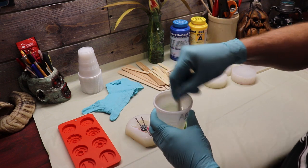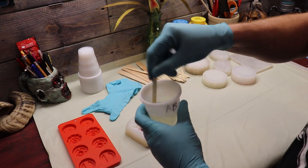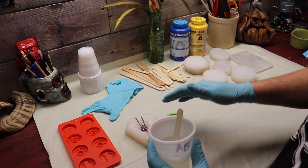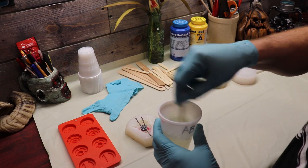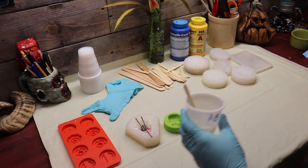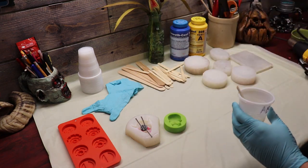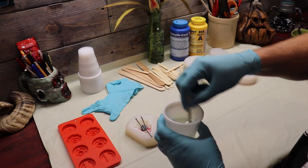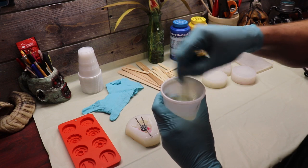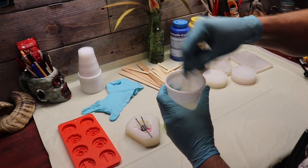We're going to mix it up real good, scraping the sides. This stuff is super easy. We've got about seven or eight minutes to mix this stuff up and it's going to cure in about 10 minutes. Then we can pop it out of the mold. Heat is a factor - if you're in a cold place, it's always a good idea to warm your molds up with a heat gun. Resin casting loves heat. This is going to feel hot in my hand - not enough to burn, but once it warms up you better start moving because it's going to start hardening up in the cup.